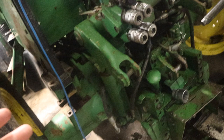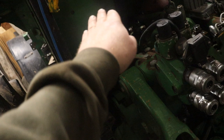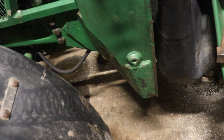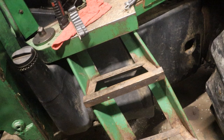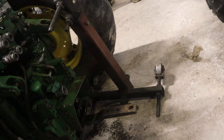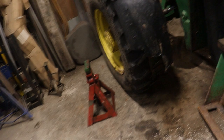So the only thing I have left that I know of — I got these mount bolts out and the hoist holding it up. I got the front drive shaft to drop and then start getting this stand underneath to hold the transmission. The wheels are holding the weight, but the transmission will just roll on the wheels, on the axle. So I got to get this under the transmission, but at the same time I got to get some jacks under the side frames or under the metal frame rail down underneath behind the fuel tank or something. Get something there figured out and then roll it back.